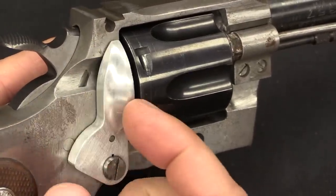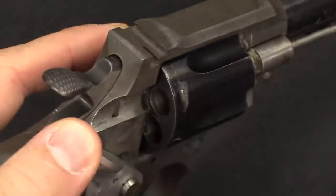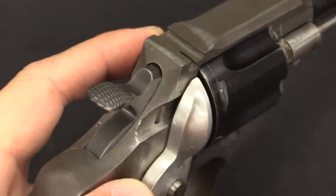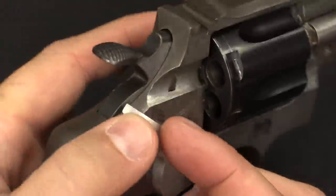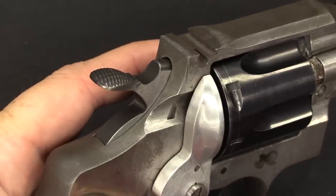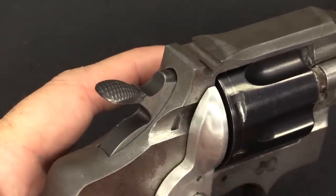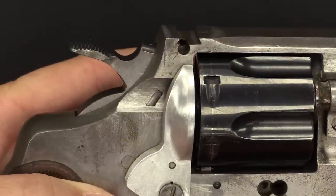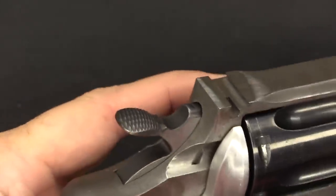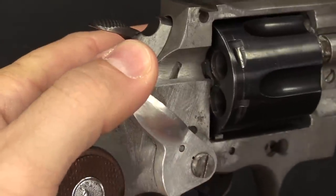There is a lightweight spring-loaded gate on the back here. There's a cutout in the frame to give you some space for the cartridge to come back, space for the rim to come through. That's going to kick this open, and presumably this will act as a deflector so that that high-velocity ejecting case doesn't come right back and hit you smack in the face. And it also serves as a guard to make sure that dirt doesn't get in and to cover up the opening — you wouldn't want that whole side of the gun to be open to the elements.